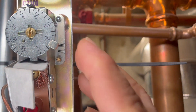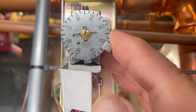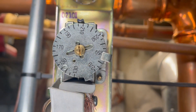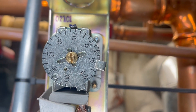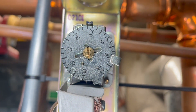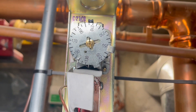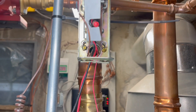So that's 200 right now. I like mine between 20 and 30 degrees differential. So I'm just going to open it up a little bit to 205 or 210. Remember if the difference is less than 20 degrees, because the thermometers are not that precise, they might turn your boiler off on high limit. So that's why I like mine at about 25 degrees. Right now it's 25 degrees, so that's what I like. I'm going to put my cover back.